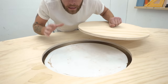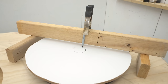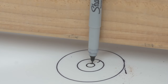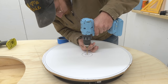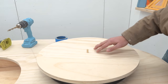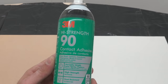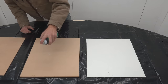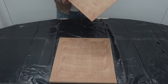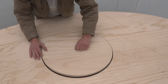Now we need to figure out how to attach the wood circle to the turntable. I stacked up a few blocks of wood, clamped a sharpie down, and let the turntable run — and it made a circle. Then I moved the pin closer to the middle until I found the perfect center of the turntable. After that, I drilled a three-eighth inch hole to accept the three-eighth inch dowel on the bottom of our wood circle. I also needed to create a platform to raise my turntable up so the tabletop is flush all the way around. I layered a couple of thin pieces of whiteboard on top of a half-inch piece of MDF and this shimmed the whole turntable up to where everything was perfectly flat.